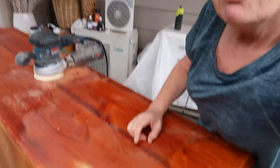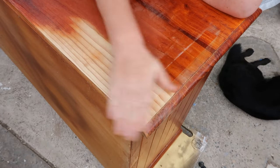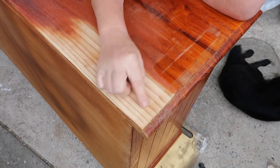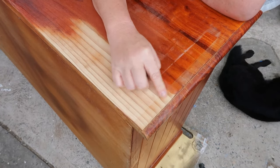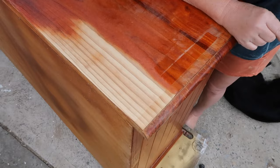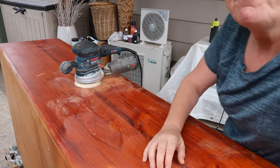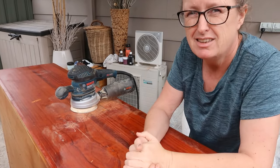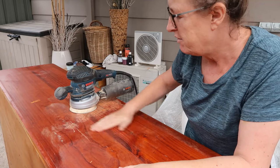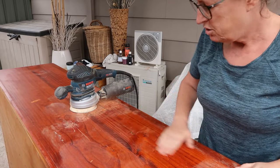The other reason I'll show you - you see here at the top the wood is stained, there's a different tone to the wood and I can't sand that out because it's veneer. I can't go further and further and hope that would go because it just wouldn't - so that would still show with the stain. So we're going to be painting this sucker. I suppose I should decide on a colour. I'll carry on and see how I go with this. I'll show you when it's done, the condition I've got it to, and then we'll go from there.